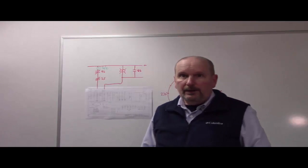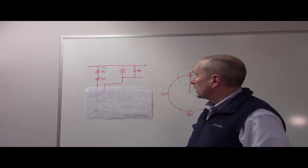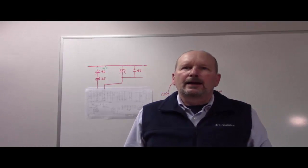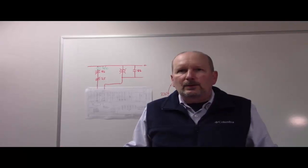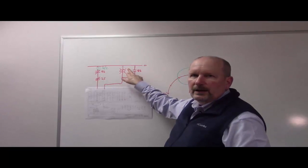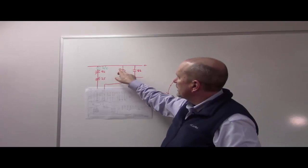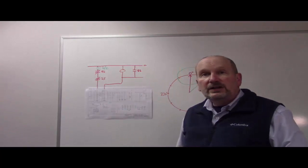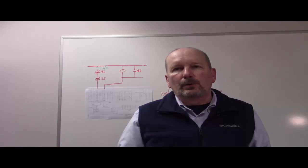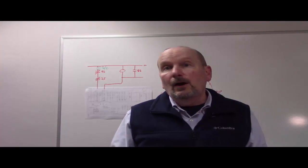This is a somewhat old-fashioned way — but you still see it a lot in substations — to monitor the health of the trip circuit. If the breaker is closed and the red light is not on, you cannot rely on that trip circuit to function when called upon to clear a fault. Of course, the light bulb may also be burned out, but it's a good indication of circuit breaker health. The problem is if no one is there and your red light isn't on, it can't tell anyone. With modern relays and opto-isolated inputs, we can get rid of the red light, treat this as a relay input, and since the relay talks to SCADA, you get positive remote indication that you have a problem with your circuit breaker.